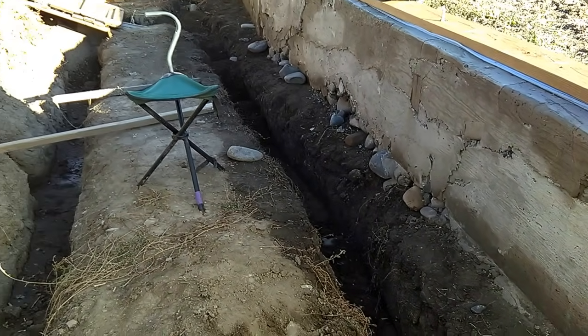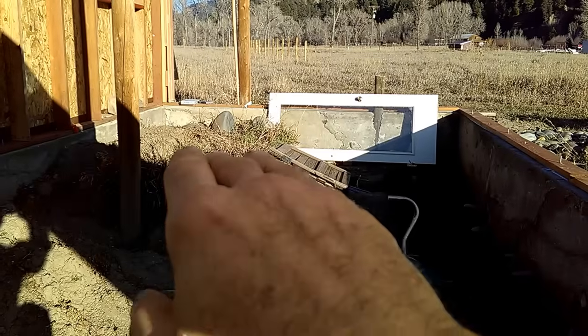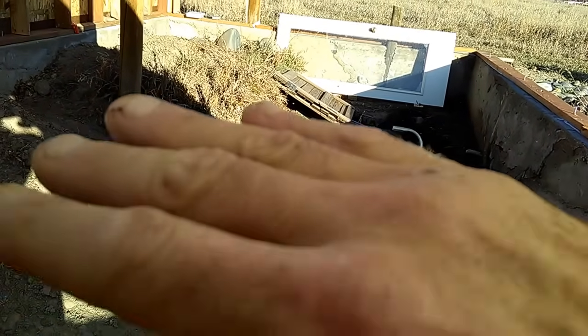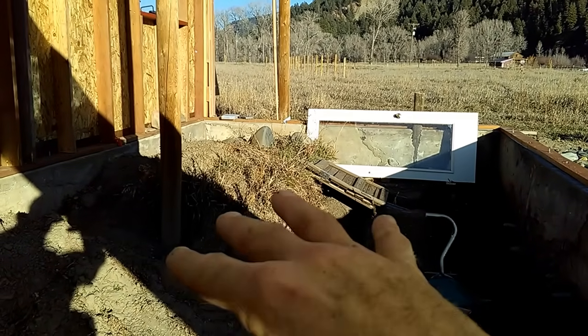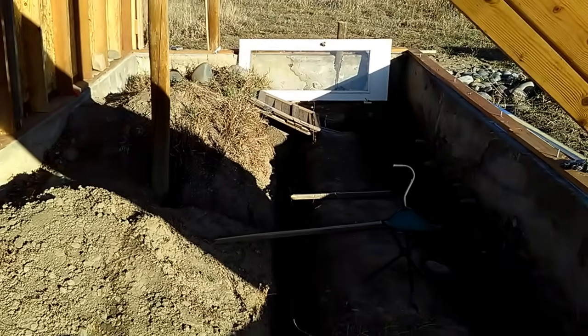We're going to have what's called drain tile in these channels — there's going to be lots of holes dug in here. Sinuous patterns of tubes in the ground capture the heat from up here in the insulated back portion of the greenhouse. It's going to suck the hot air from up here into the ground. We're going to utilize Earthship technology — at three feet in the climate battery here, we're going to be using tractor and giant truck tires and ramming earth into them. So we'll have layers of rammed-earth tires as the climate battery. Below that layer will be the drain tile that deposits the heat from up in the greenhouse into the ground, where it'll come up into the rammed-earth tires and store itself for later use at night.